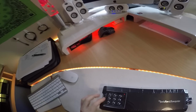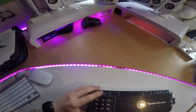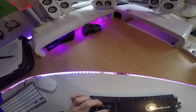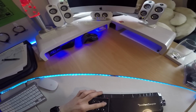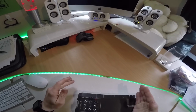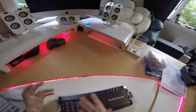What we've also got at the very top is an input clip LED. That'll let us know if any signal coming into the amplifier is distorting or clipping. And then you've got output clip LEDs for each set of RCAs, your front, your rear and your sub. You use those LEDs when you're setting up the gains to set the system at a state where no matter what volume you have the system at, it can't distort on the output side of it. And so you can use those LEDs to tune it.